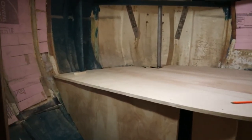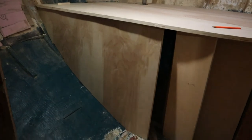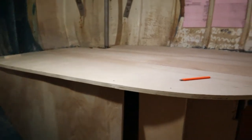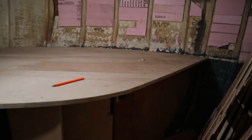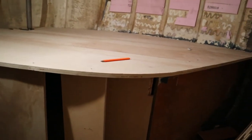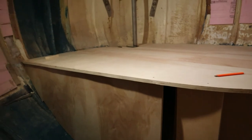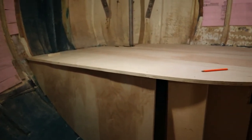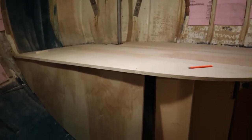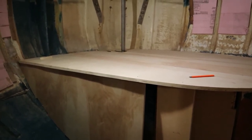The piece is in. It's not a bad day's work - everything seems to take a long time, but that's the way it goes. Here's the whole thing, the way it looks right now. That area between the old bulkhead and the new bulkhead - I'm going to get some flexible plywood. It seems like there's plywood available that you can flex, so I'm going to see what that works like and try and get a piece. The aft cabin is coming along quite nicely.